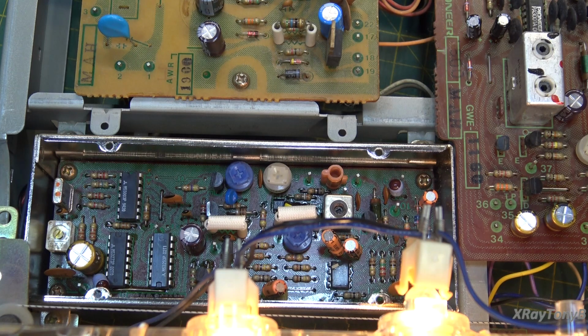What the purpose of the APC circuit is, this is a special tuning circuit that when you're on FM, it will actually find a channel when you hover over it, and if you're within 40-50 kilohertz of it, technically it should be able to lock in and center on the channel. Now, its intent is to make it easier to tune in stations, but when it malfunctions, it does the opposite. It causes your station to jump all over the place, causes your meter to go crazy. Can be very, very finicky.